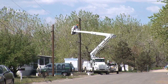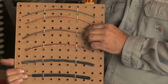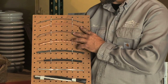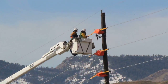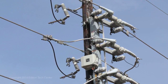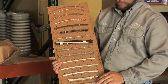Some of the older conductors we're replacing out on the lines are the number eight copper, number six copper, and number four copper — all conductors used back in the 20s and 30s when copper was cheap. The older conductors typically used 2,400 to 4,160 volt primary conductors. The new voltages we're using now are much higher, and we're using the bigger aluminum conductor to make up for the difference in size compared to the older copper conductors.